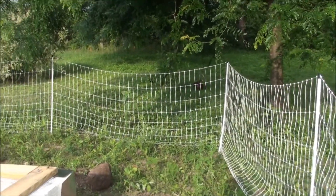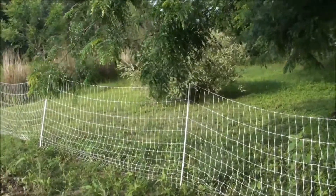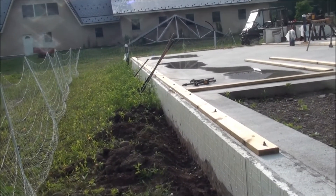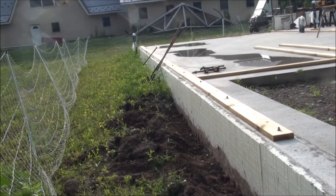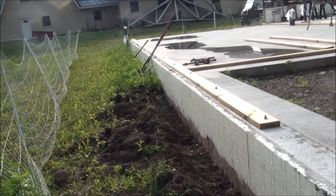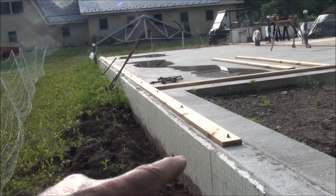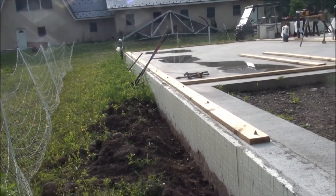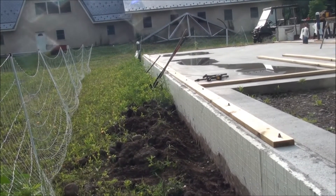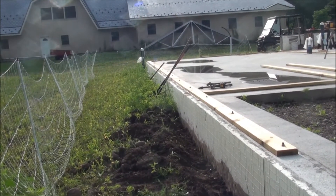This last fall after I got the concrete pad poured we did some quick backfilling around the perimeter of the building. In this chicken coop area I didn't put any vapor barrier down up against the styrofoam — I wasn't concerned about moisture getting inside, it's all rock and fill inside. The fill level is going to come up much higher, I'll grade this off with a slope away from the building. However, the insulation is also very appealing to chickens — they will peck at it and just poke holes right through it, so we want to cover it up.